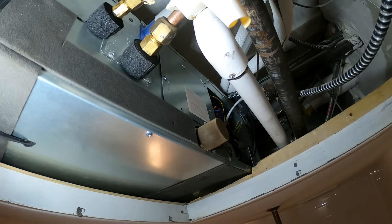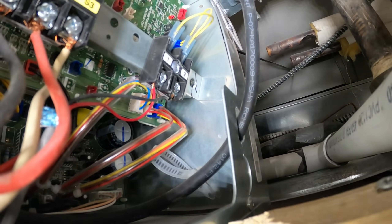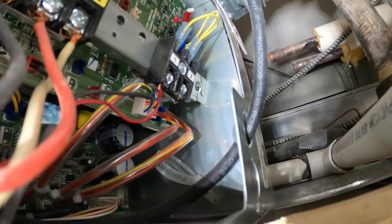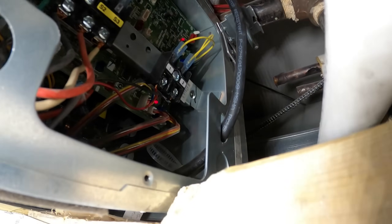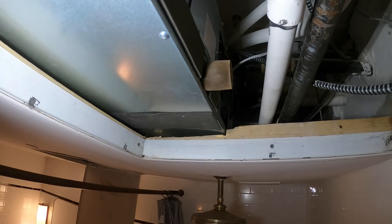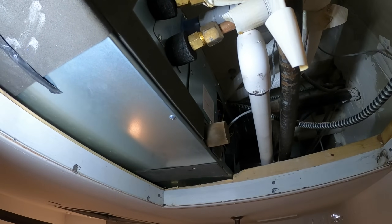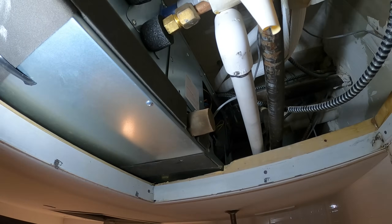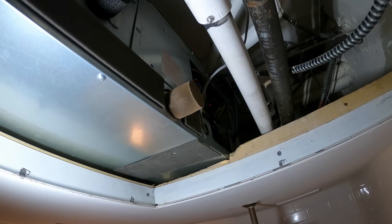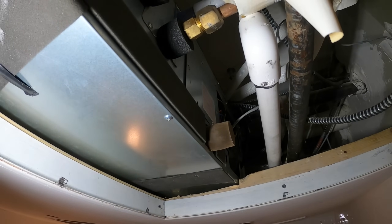In the ceiling we have one indoor unit — one condensing unit, one outdoor unit, one indoor unit. The problem is the electrical cover is missing. Look at this wire coming in through — this is the thermostat wire, and that's our communication line: S1, S2, S3. This whole thing is a mess. It looks like we're getting power and communication from the roof and we have this little thermostat cable here. They don't use knockouts or grommets. I don't even know what model this is.